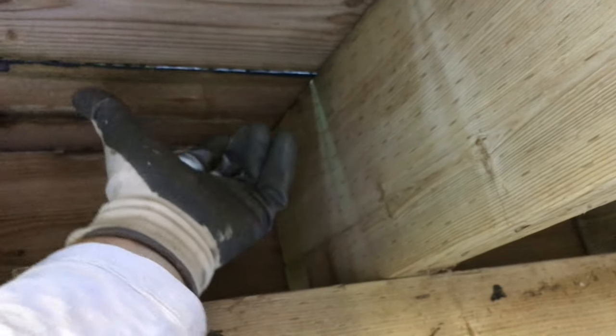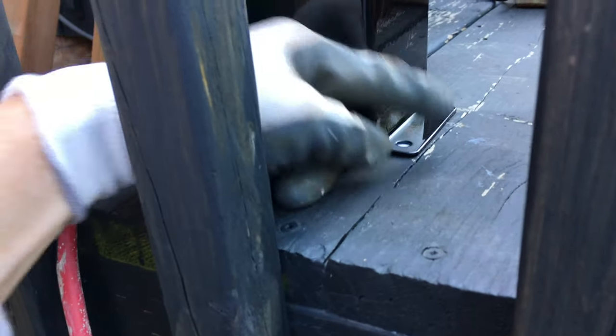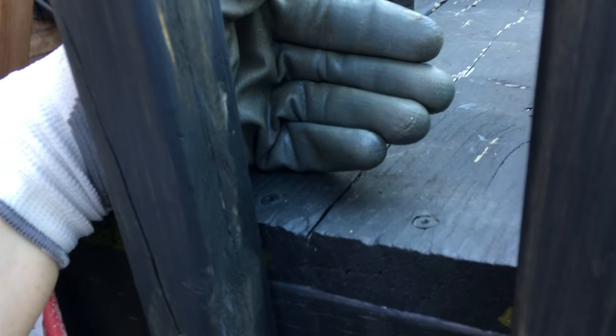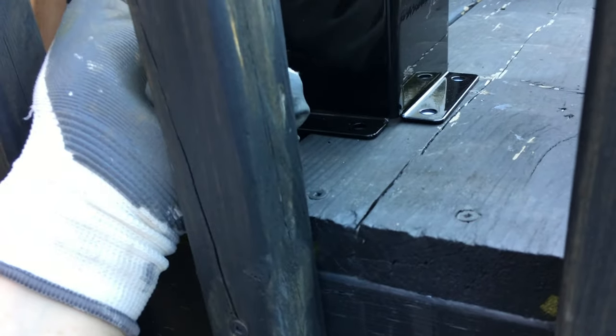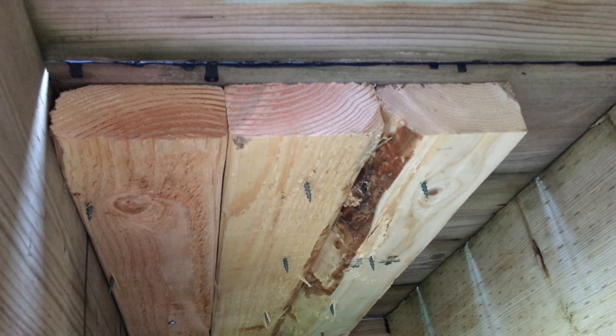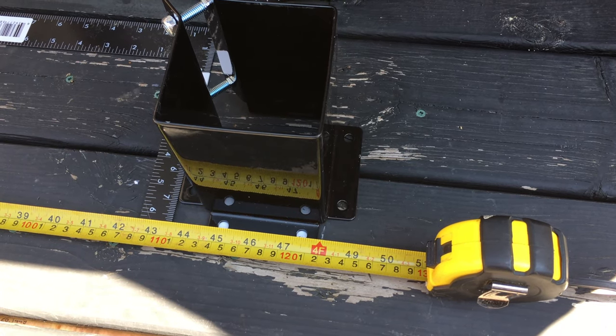Not something all of you have to do, but I think you need some support underneath. That means placing some wood — 4x6s — right here going across, as additional supports. We'll place huge screws through here so it supports this wood, which is older and needs that additional support. Even with new wood, I'd put that additional support right underneath. We're placing three of these right across as our support.